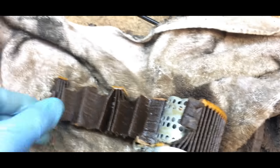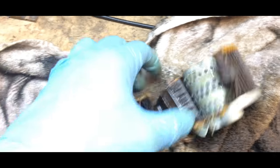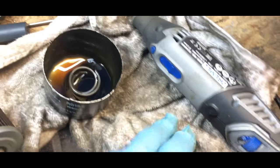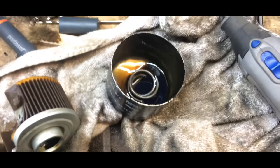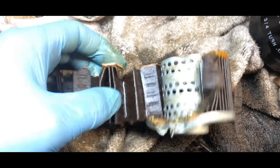According to the Rotax maintenance manual, after you replace the oil filter, you have to open the old oil filter to check it for contamination or particles or anything that shouldn't be in engine oil. Only the problem is that it is a very, very hard job to open this old oil filter. So I opened it with my Dremel, to cut through the iron, but that is of course not a very good idea, because during that process iron particles are already coming into the filter. So what I did was not a very good idea.